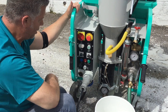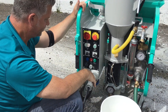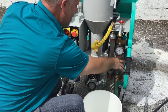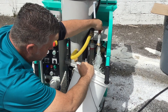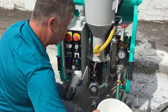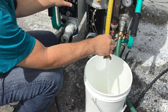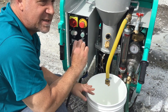Reverse will only work when you're in reverse mode — if you're in the middle or in forward, hitting reverse won't do anything. With water pressure coming in, one thing I always like doing is, once you've got your water set, turn your pump on and let some of the air pressure out just to clear the air line. You'll be able to see the air come out when you do it. The water feed switch controls your continuous water feed. Once you set the water to one liter, it will always stay that way.